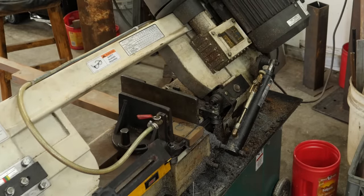The finer the finish is, the less peaks and valleys there are for the epoxy to go down into and really bind to the parts. I let the epoxy set up overnight and then shaped the ends of the handle. Something I had to work on was thinning my tang just a little bit so it would actually fit in the slot. Unfortunately, in a heartbeat I accidentally took too much off and made it so my blade could wobble in the handle a little bit.